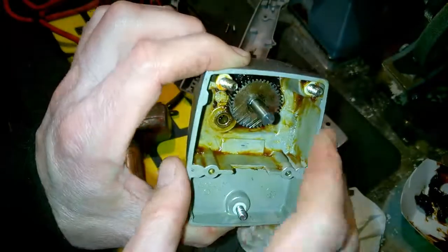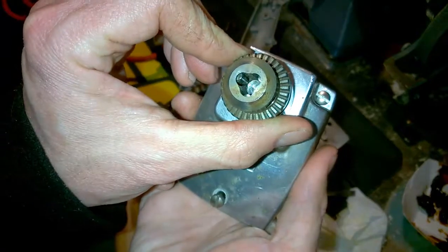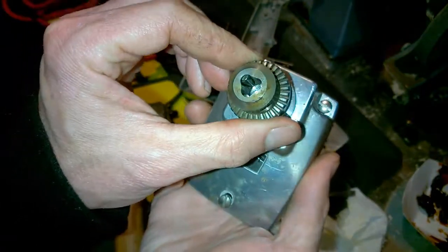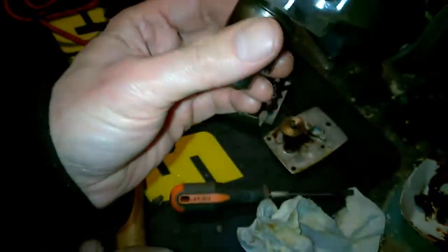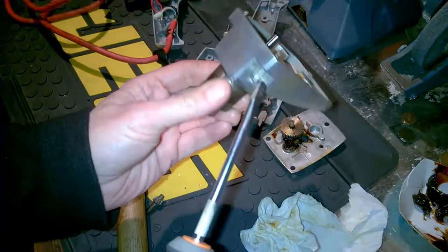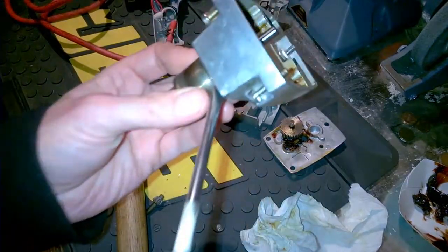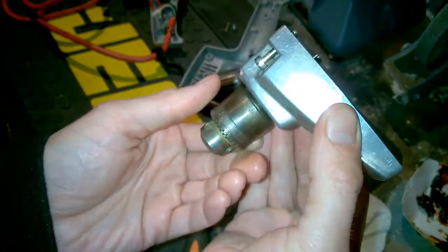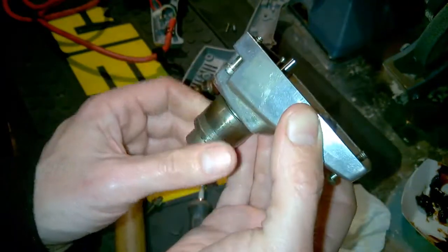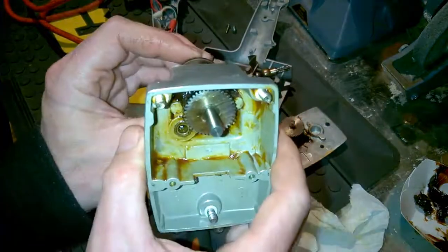All right, well, I've tried a few things. Tapping on this one way, tapping on this the other, opening up the chuck to see if I can unscrew it with an Allen key on the inside. It's unfortunately not like that. Looks like it's a tapered one, and I can't get this thing budged out. I've tried pulling on it, using a screwdriver in here to try to wedge it. Sort of like, you can wedge these tapered chucks off, and that's not moving anywhere. So rather than go through all that rigmarole for no real gain, I'm just going to clean this up as is, pack this back up with some fresh grease, put the gearing back in, and we'll start getting it back together.